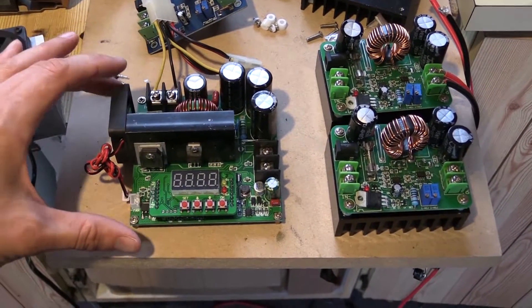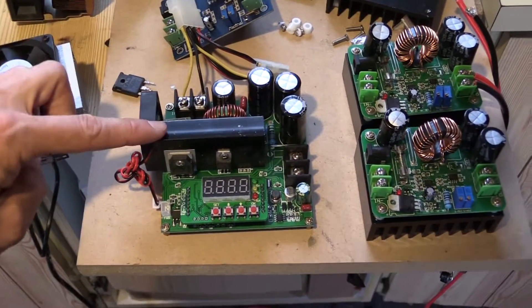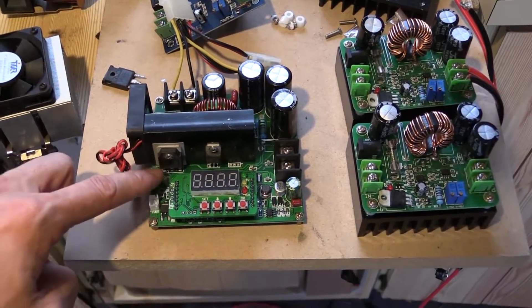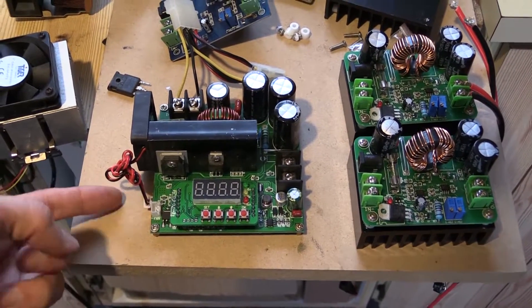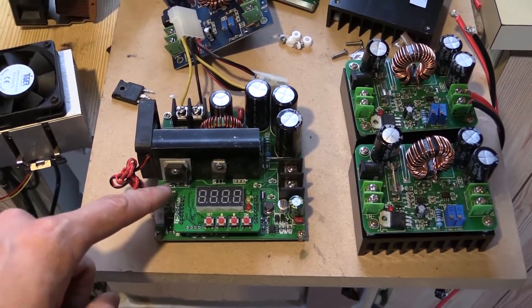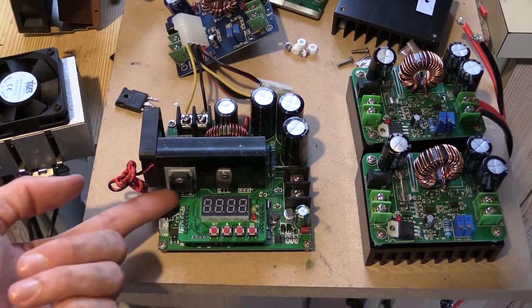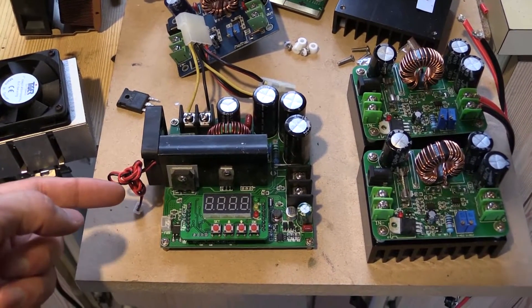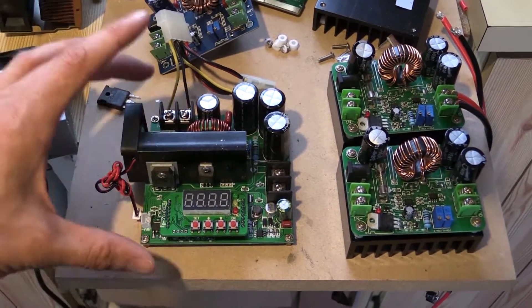This unit here is all going. What I'm planning to do is fix or upgrade the cooling solution. To do that, I'm going to unscrew this power MOSFET and unsolder it. Now this appears to be a dual layer PCB, which is going to be a bit of a pain because I haven't really worked on too many dual layer PCBs. It's got solder at the top and the bottom, so it's got tracks that go to different places, so I'm going to have to be a bit careful.